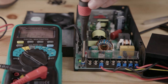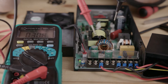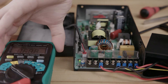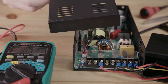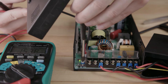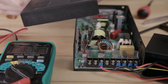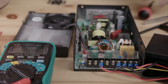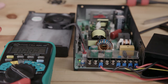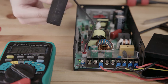So let's go down, until the fan seems fairly quiet. This is 21.67 volts. Let's lift the fan up to see. Before we were up like this, it was much louder. It's around 21 volts. Let's hear what 20 sounds like. And it's close enough. So the point is that if we run the fan, this bearing is not in good condition.